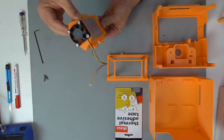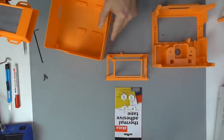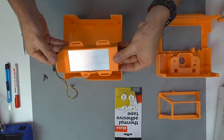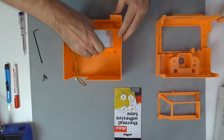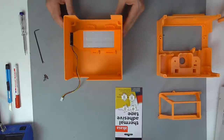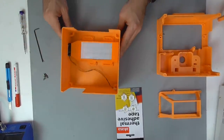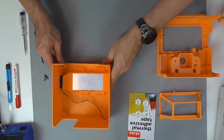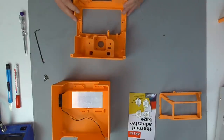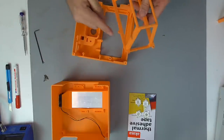But before we can install our 4 high power LEDs, we need to find out which spot on top of the aluminium heatsink is available for placement. Therefore, we roughly and temporarily assemble all relevant components of the printer body and just set some marks on the available spot for the LEDs. This includes a temporary installation of the UV reflector frame inside the core component.